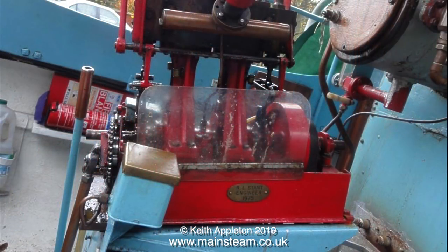Here's a magnified view of the same photograph. You can see from the oil tank there's a pipe that goes to the oil pump, which pumps oil to the bearing. Because there are oilways drilled from the center part of the crankshaft through the crank webs to the crank pins, this is how the lubricating oil is supplied to both of the big end brasses. There's a small oil tank on the other side and this is the reservoir for the oil that gets pumped into the cylinders using the high pressure mechanical lubricator.